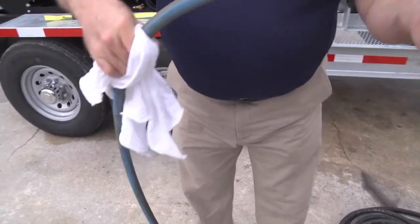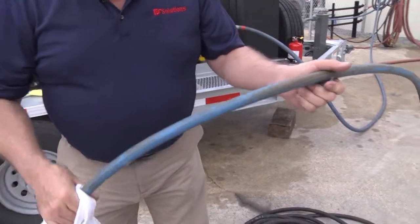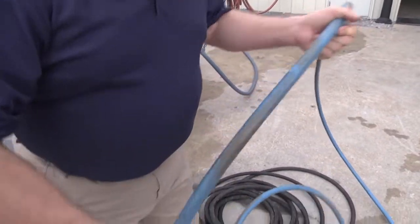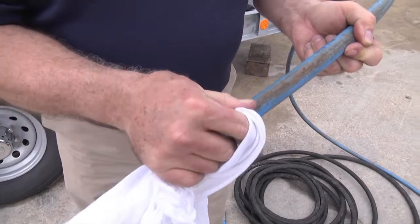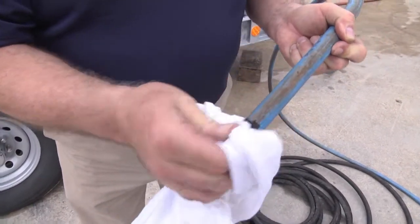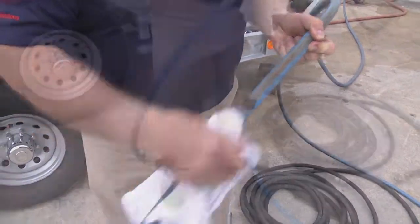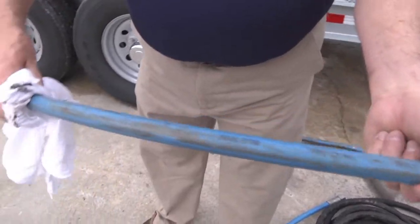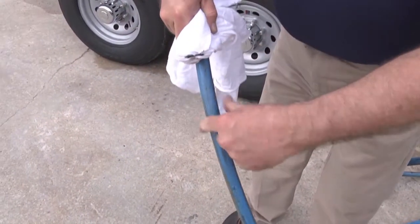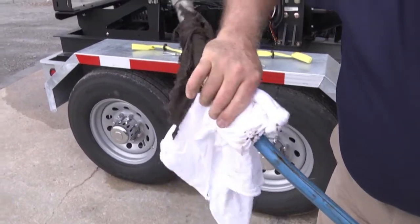And generally anything else that would give me pause before I would use that hose in service. Rough spots. This is a piece of extraneous material, so once again, we want to try to remove that if possible to make sure there's nothing bad underneath. And it's easy to just wipe this through a rag, wipe it through your hands, because any defect is going to grab the rag and let you know